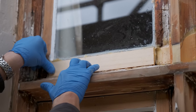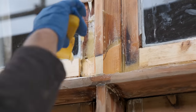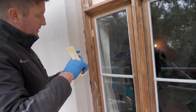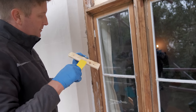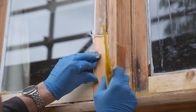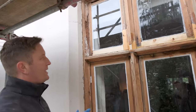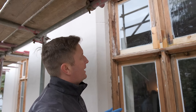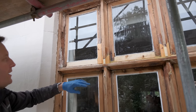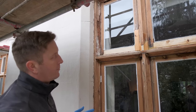See that's squidging out — exactly what we want. Same as before: get the hides filled. Very important — get the mitre filled. I'll just put it in and see how it sits while I mix some more up. We'll soon see where it's touching and where it's not. Okay, so all these pieces are now set, which is where I want to be. So then I can start going in, filling all these areas. I've got time to make it look right and get it all sealed up properly.